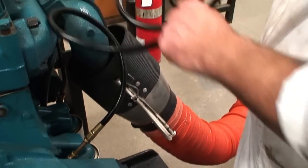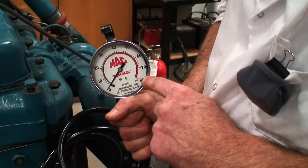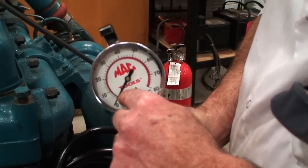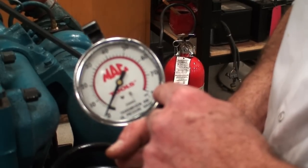Taking a look at the engine oil pressure gauge, we have 80 psi on it. We can read small increments up to 20 in one-pound increments and then in two-pound increments right up to 80 psi.